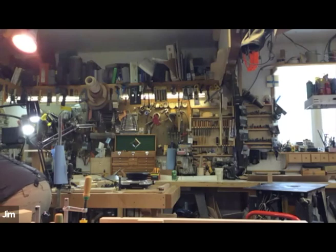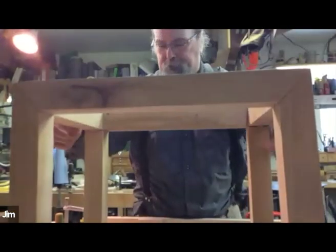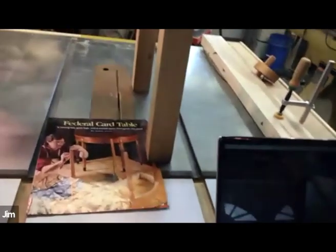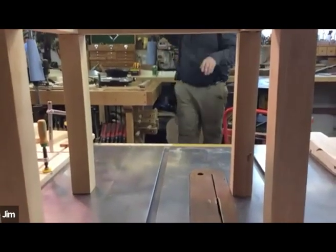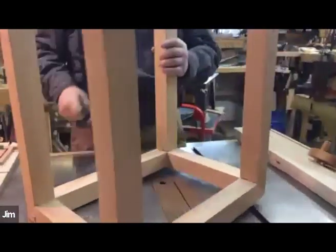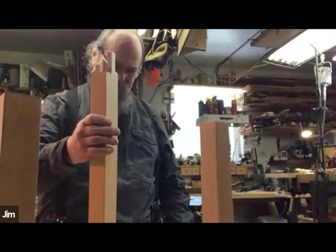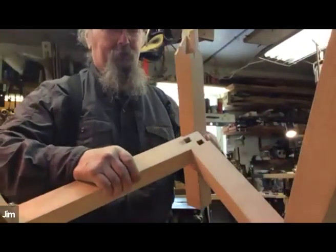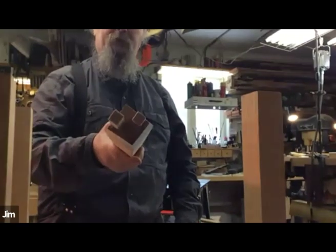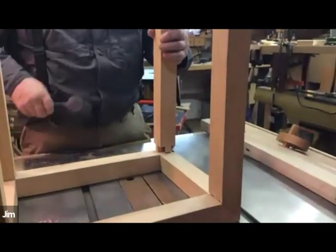Here's another cool little deal. This is what I've seen in Fine Woodworking magazine — Chinese three-way miter joints. That's the joint — it then goes into that. I've already glued the top together, but it's similar. Try to cut that out sometime if you want practice — all done with hand tools. I'm going to make a tuffet or something out of it. This is oak and this is maple. I'm going to ebonize the oak so it's black and then do an elk skin tuffet top.